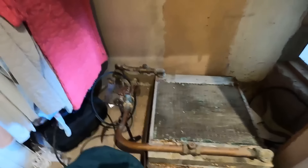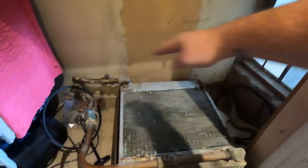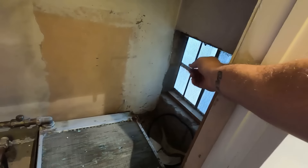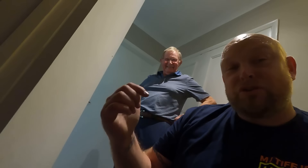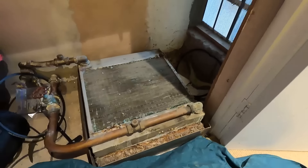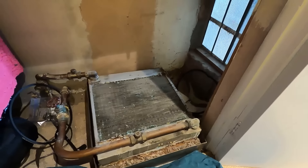David and I stripped the top of it out the other night. This is the heat exchanger — that's a flow and return that comes from the boiler at the far end of the house. You've got your flow and returns coming up here in 28 mil. You basically got a box that goes around it with a fan on the top. The fan sucks air in through there, through the fan, and shoots it down through this — it's like a radiator.